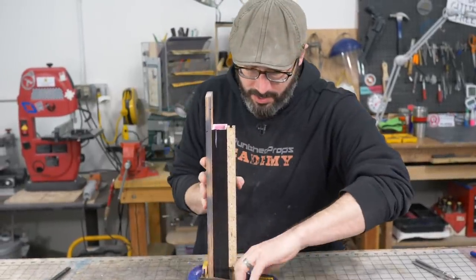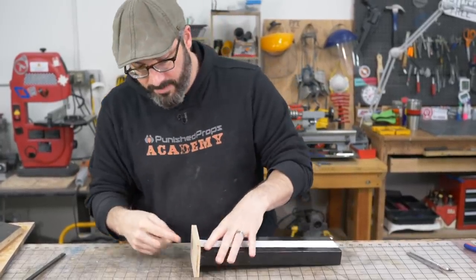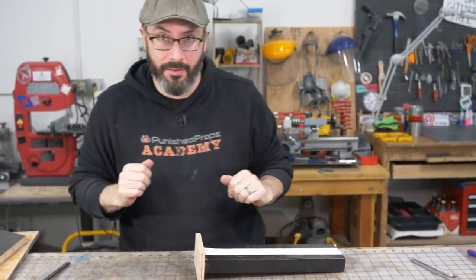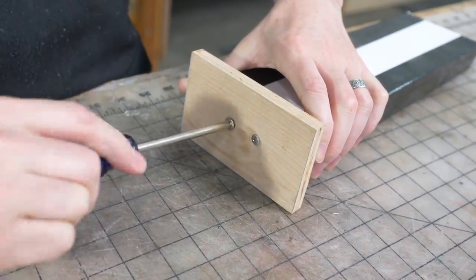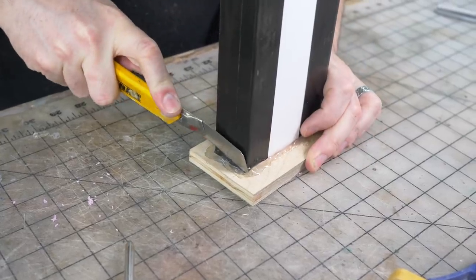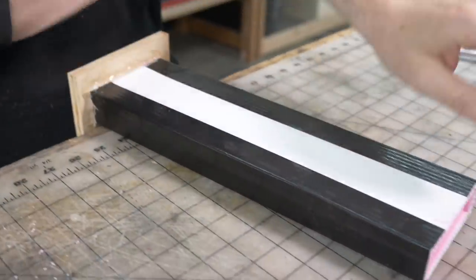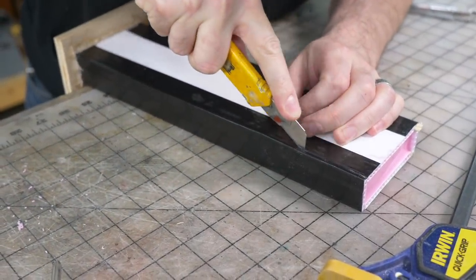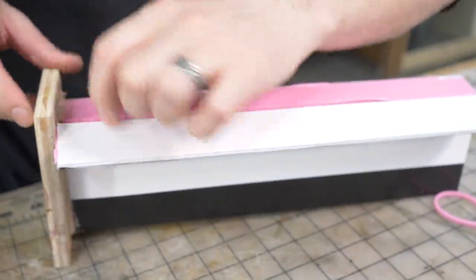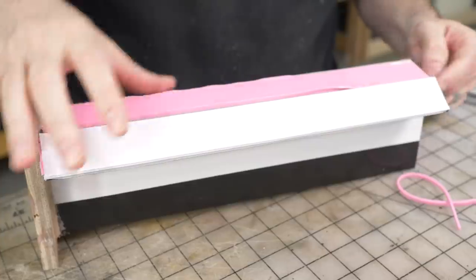I take off the improvised mold walls and unscrew the support screws out of the dagger bottom. I carve the box open to help release everything. Something I didn't foresee using coroplast is that the silicone seeped up into the walls, meaning I had to keep topping it off. I usually use stiffer plastic — foam core is pretty good, sometimes needing reinforcement — but you can't really go wrong with half-inch plywood. Lesson learned: don't use coroplast for mold boxes.